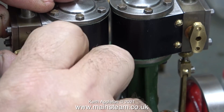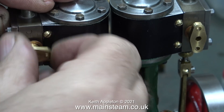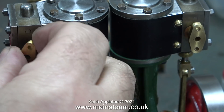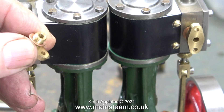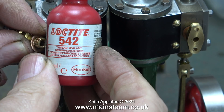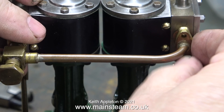The first thing to do is to fit the other inlet manifold flange. In the bag with these pre-machined exhaust flanges were some aluminium washers, but I'm not going to use those. Instead I'm going to use some copper shim washers to make sure that the inlet manifold flanges are in exactly the right place. I found two shim washers that were perfect for the job, and this allowed me to accurately align the inlet steam flange with the other one. As usual I will be using some Loctite 542 thread sealant to seal the threads. Although as I'm using these copper washers the sealant isn't really required, but I always use it. Steam leaks on engines and boilers in and around brass fittings can cause problems with corrosion. That's why I always use Loctite 542 — but do not confuse it with Loctite 603; that is a retainer.